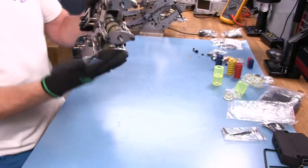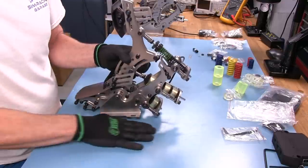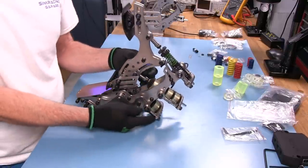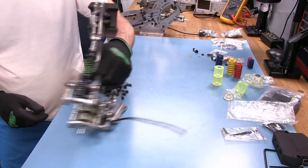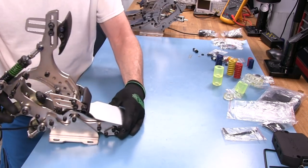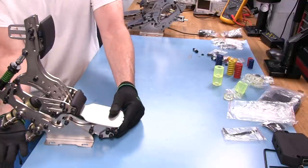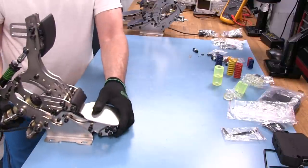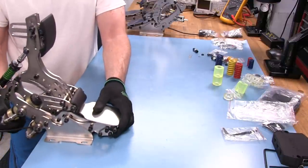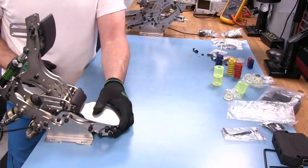And I was telling you that you need some hangover on the bottom here, because if you have this on here and just have it on a flat surface that extends, then you can see it's bumping here, and obviously you're not going to be able to use it that way. If we hang it off the edge of the table here, or my bench, then you can see the flanges are sitting flat now, and we have all this room under here that we can use. So everything's free to flap around now, and we can use it however we want to. And you can see I can move this stack around a little bit too, because I put the shim in there and there's less preload on it.